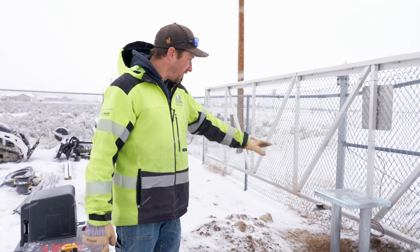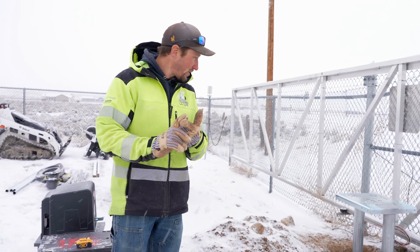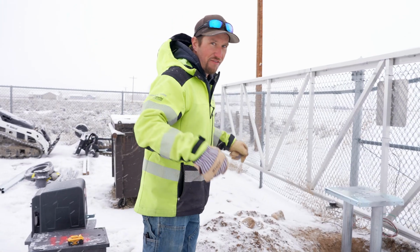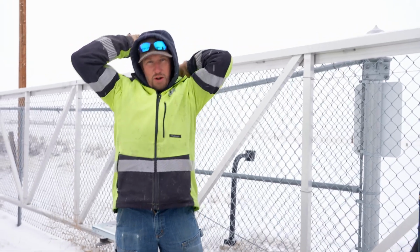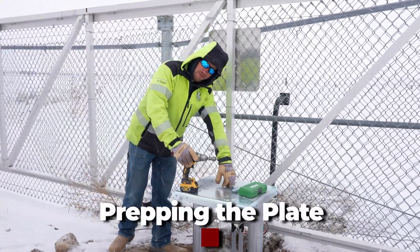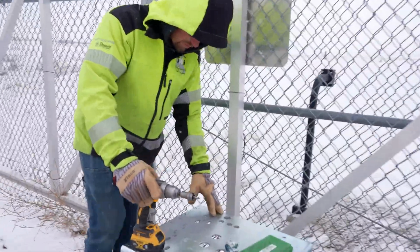Going off of what they already have that's existing, they have a 3/4 inch conduit for the keypad, so we're gonna have to tap onto that, and then 2 3/4 inch conduits for the loops. Let's just dive right in. And it's not cold, don't worry. There's 4 1-inch holes already for stubbing into the power, but we're gonna go in with some smaller conduits.